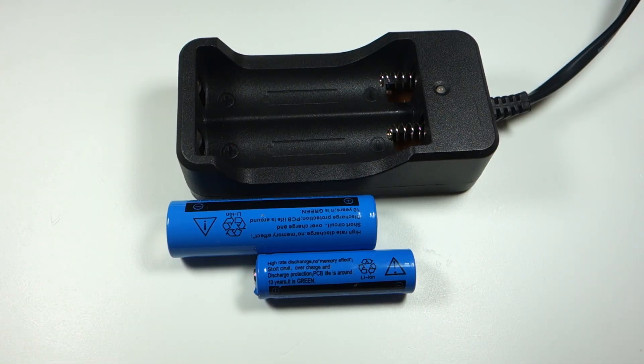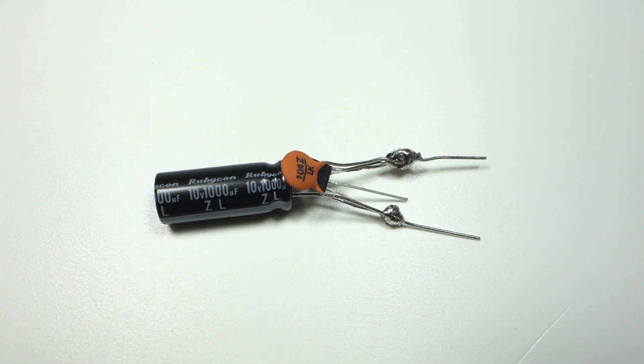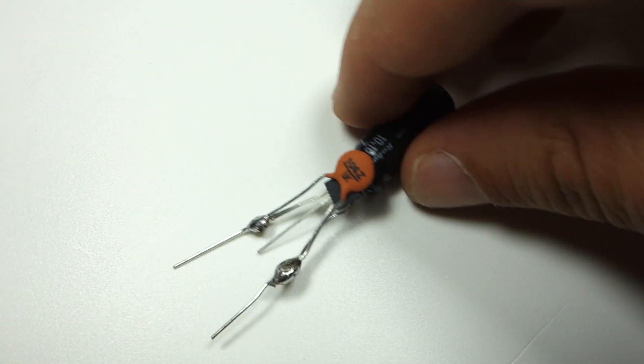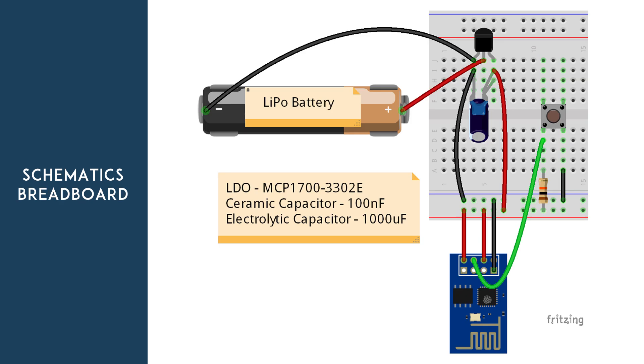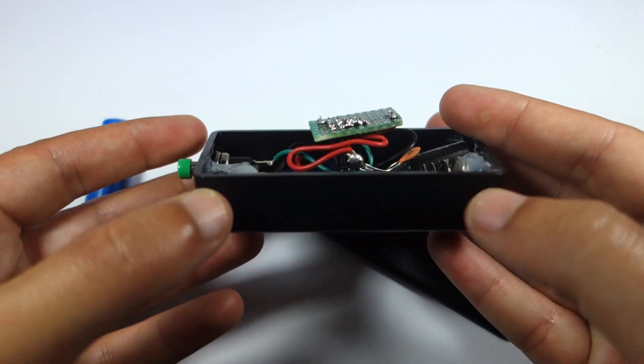For this project, we want it to be portable and easy to make, so we're going to power the ESP with a lithium battery. To power the ESP safely with a battery, you need to make a voltage regulator circuit — we've also covered that subject in a previous guide with a link below. After having the code running on the ESP01, here are the components you need for your circuit. I recommend assembling the circuit first on a breadboard to test if it's working properly. Then you can make a permanent circuit with a small stripboard and a few wires.